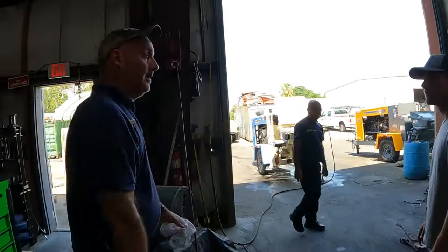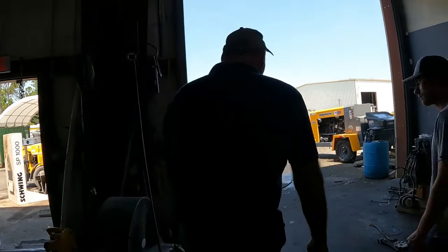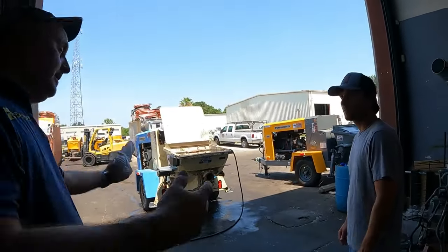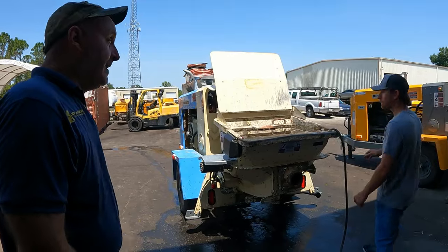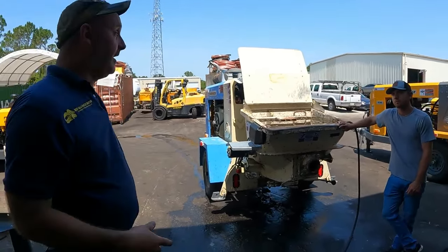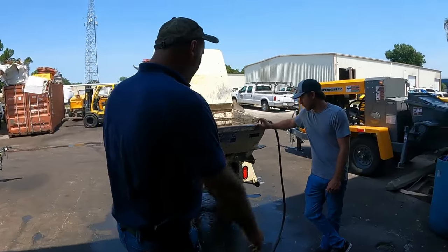Keep adding oil from the hydraulic tank and you put the degreaser in there. I mean, you can do it somewhat, but then you're always using oil. I mean, you gotta refill the tank. That means you gotta put new oil in, which is dirty. So what's in the machine stays in the machine. If you want to, I keep a 5 gallon bucket of hydraulic fluid and I'll mix it at the shop, put some diesel in it, and then use it for a sprayer. I'll never take it from the machine.